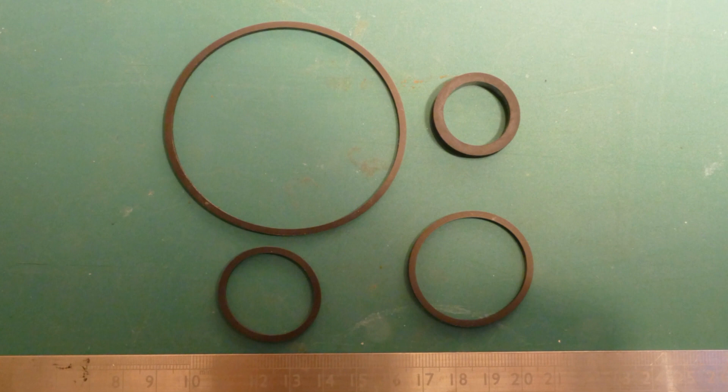I would recommend replacing all three drive belts plus the reel idler tyre. I will provide information below on suggested replacements. These won't be original manufacturer spares — they are probably impossible to obtain now — but parts I've found are perfect based on their size. There's a small belt for the cassette carriage drive, a slightly larger belt for the lacing motor (the fiddliest to install), a large belt under the reel drive motor, and a tyre for the reel idler assembly beneath the cassette carriage between the tape spools.